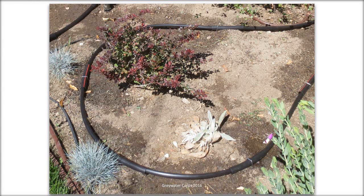Lee, if I could interject there, the quarter inch holes, they will clog and they will need more maintenance than the other kind. Laura is right, they will. If we do these kind of systems, instead of annual maintenance, we usually do some kind of visit every six months.